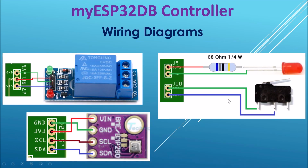Right, next up, the wiring diagrams. To show you how to connect everything together, we've provided a whole lot of wiring diagrams for you, which show you how the various things are connected. So for example, the relay here goes VCC, ground, and in. So IN goes to signal, ground goes to ground, and 5 volts red goes to the VCC pin. NO and COM, normally open and common, or NC, normally closed and common.